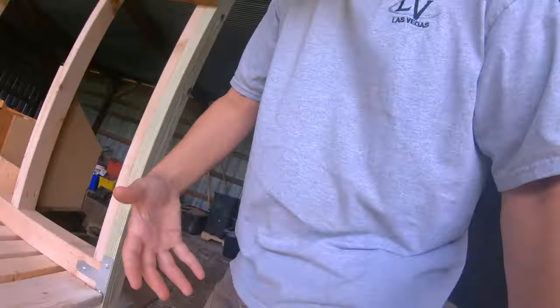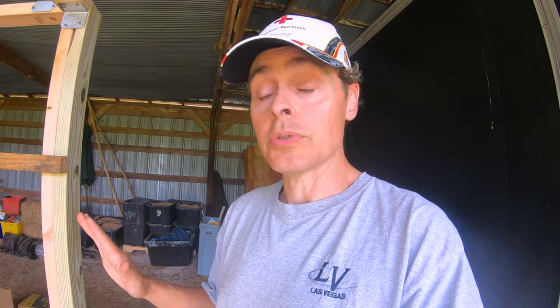Today, I'm in some grubby clothes because I should be able to get to a painting stage today. I need to prime and paint the siding. And the doors, I'm going to use a marine spar varnish on both sides before I paint. Hopefully to prevent some warping, I'm using half-inch plywood, and warping may be an issue with the doors.